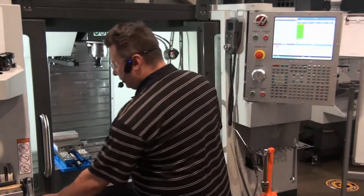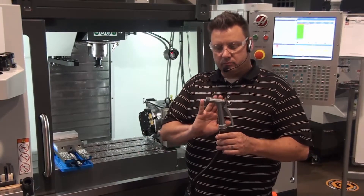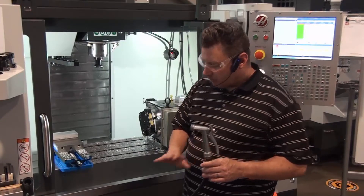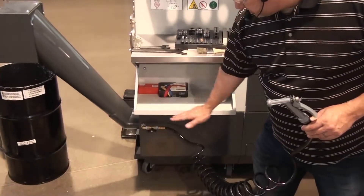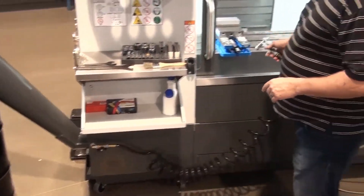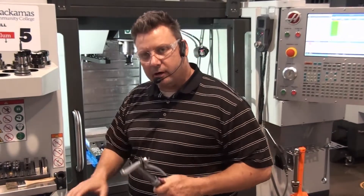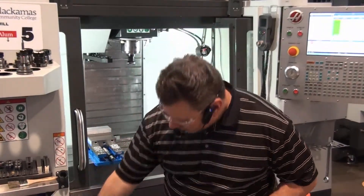The first thing we need to know is that we have a coolant source on the front of the machine. Currently the valve's open — if the valve is horizontal, we're going to get coolant out of here. If you depress the trigger and no coolant comes out, even after you turn the coolant motor on, make sure to check that valve underneath the front of the machine.